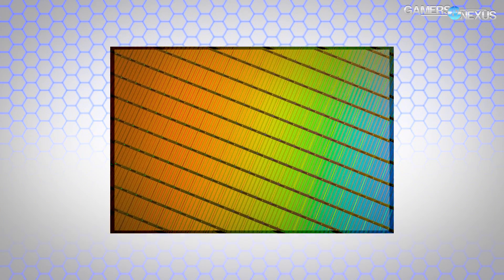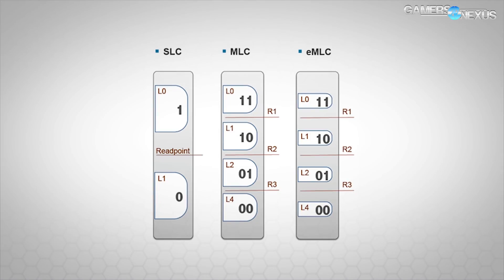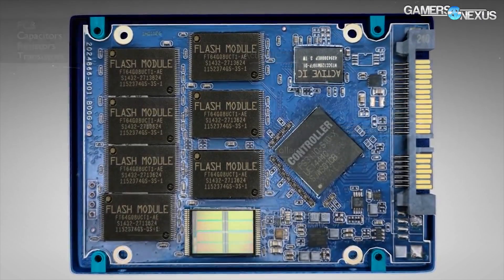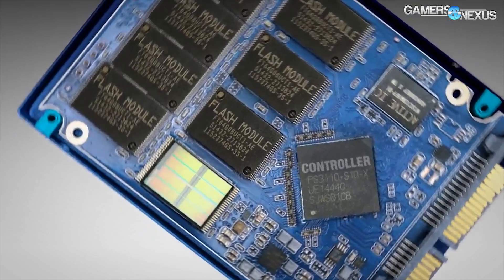The last news item is Micron's new 3D VNAND for mobile devices. You've all heard of 3D NAND or VNAND — Samsung is probably the originator of that technology on the consumer market for SSDs. This is the same idea but for mobile devices. Micron's new 3D NAND goes up to 32 gigabytes, making it among the largest storage solutions on the mobile market. It stacks cells vertically, as with any VNAND, and has the smallest die on the market at 60 millimeters squared, making it a great fit for mobile phones.